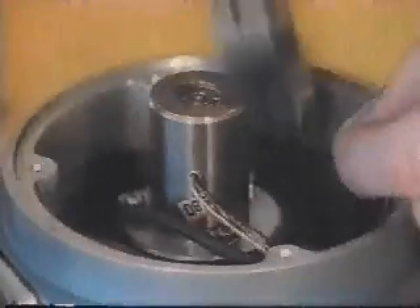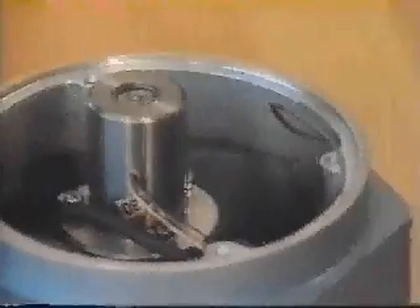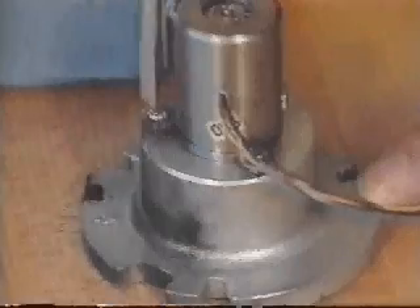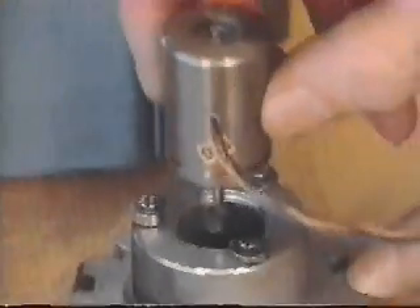Returning to the end bell, we've loosened screws, cut wires, and removed the mil-spec connector. After the coupling between it and the motor shaft has been loosened, the feedback device can be lifted out and detached by undoing the three half-turn fasteners holding it to its mounting. This is one of several feedback devices used with servo motors.